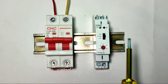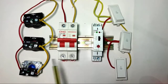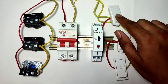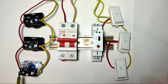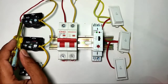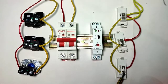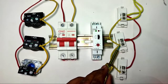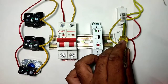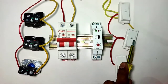If you want to control this staircase timer switch from multiple places, connect push buttons using the NO (normally open) element. For home use, connect doorbell switches. For control from three different places, connect three switches. Connect all push buttons in parallel — all push buttons in parallel, using the NO element. Two wires go into the staircase timer switch. Connect a yellow wire at all switch bottom positions and a red wire from all switches' top positions — this makes a simple parallel connection, and these two wires connect to the staircase timer.